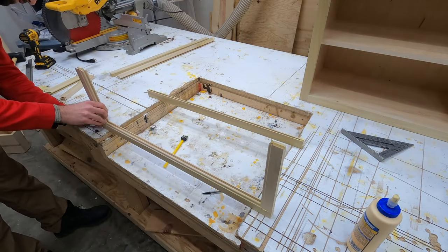There is one downside to the french cleat system - the shelves are held onto the wall by their own weight caused by gravity, which means if gravity somehow became non-existent these cabinets would float off and crash through the roof. So to stay one step ahead of whatever gravity decides to do, I'm going to bolt the top section right into a stud on the wall - which is what that top piece of scrap plywood was glued on for, and also why we left that three-quarter inch gap when cutting the dado grooves earlier. In all seriousness, that top bolt is just to make sure these stay on the wall in case they're accidentally bumped or pushed upward where they would pop off the french cleat.